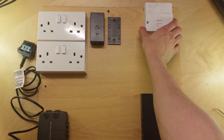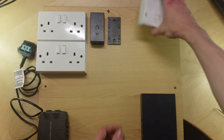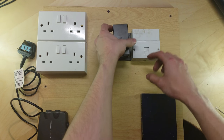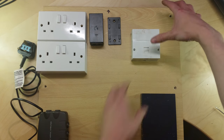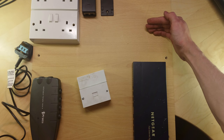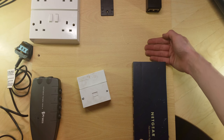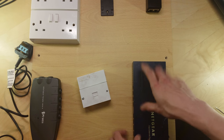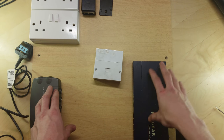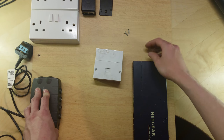So I think I've now worked out how I'm going to position things. I think this phone socket is going to go up here — maybe there or there. The advantage it has is it's only ever going to be that big. The PoE injectors though are that big before the power cable or ethernet cables are plugged in, so they're going to take up more room. The reason I don't want to put them here is because they're going to eat into the space for the network switch. So if it was upgraded to a 16 port one in the future, it may not fit because of the connectors on these injectors. I'm going to mount these sockets and this TV amp now.